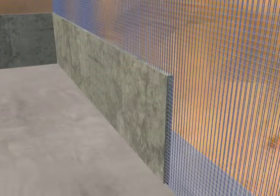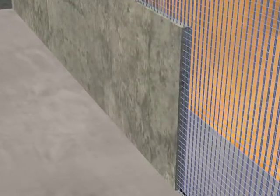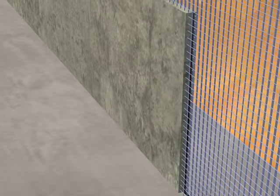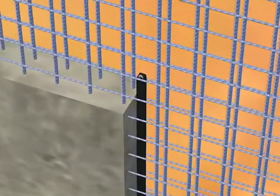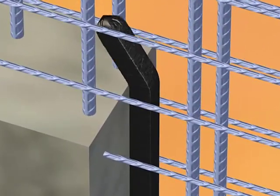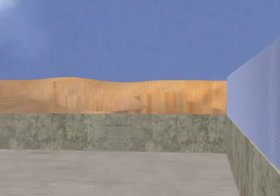To seal the vertical joint between two successive pours of a wall, water bar should be laid on the vertical surface of the wall which is already cast. It easily sticks to the wall. However, if it is difficult to stick the water bar strip, as for example in wet vertical joints, bend the water bar over slightly to the top surface and tie it to the nearest reinforcing bar. After laying Dr. Fix-It water bar, you may cast the second pour of the wall.